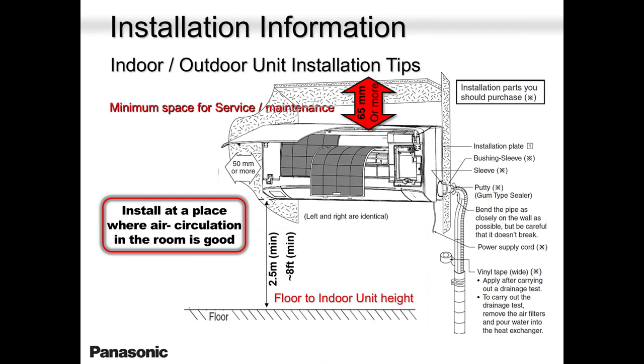Heat pumps, especially when you're doing heat pumps for heating, always make sure you have enough room on top, guys, because if that heat gets trapped over there, it's going to put that unit to sleep. That unit is going to sleep and the guy is going to get frozen. I mean, not frozen, but he's going to feel cold. He's not going to feel comfortable. And the moment he bumps up the temperature, everything is up and running.